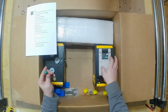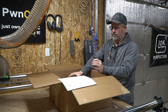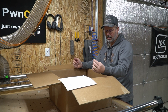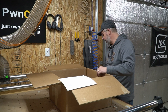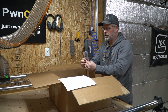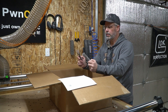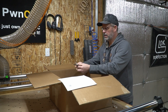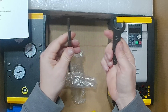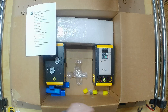We've got an IOT plug that will connect to the side of the VFD — you can run that to a smart power strip for your dust collector or anything else you want, like a pond pump if you're going that route. We've also got a couple of special wrenches for the ISO 20 tool holders. They don't look like regular wrenches — they're very thin in the locking area so they fit into the ISO holder.